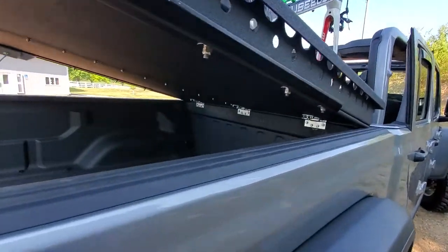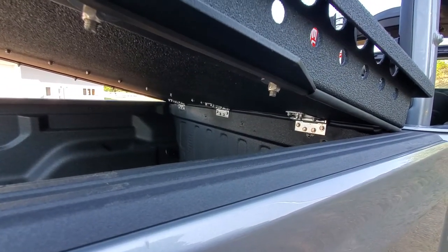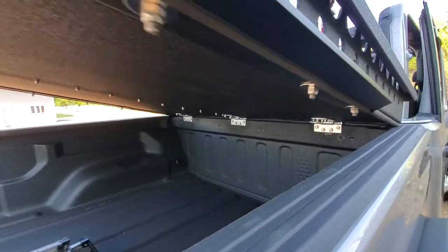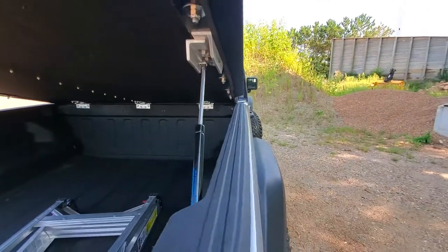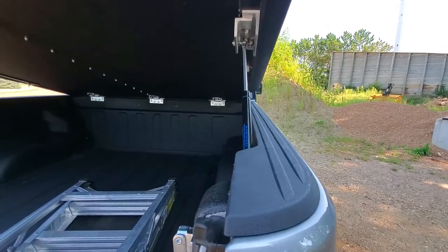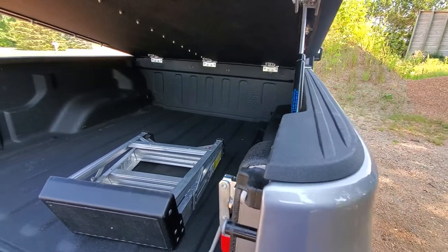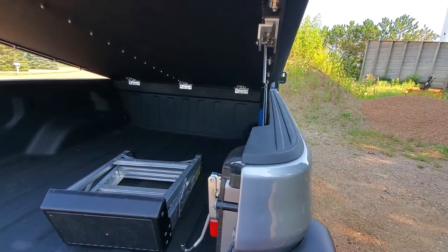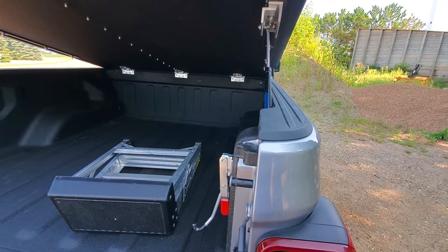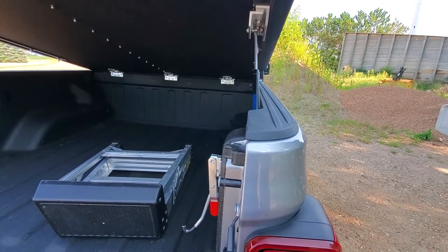Now I've got four bolts multiplied by three hinges, over about 12 times the surface area, so to the extent that there's any side torque on that panel, it spreads it around. The other thing I didn't like was — if you look down the line of this original Upper Decker — the entire weight was always resting just inside this rib. They tell you it holds 1200 pounds and I have no doubt, they did a great job engineering the structure. The problem is it isn't spread out over anything, so it's highly concentrated.